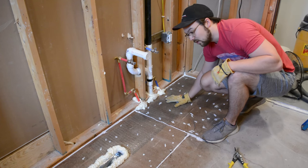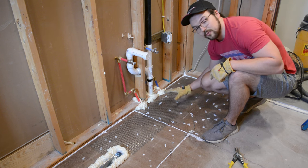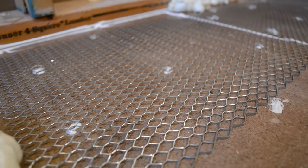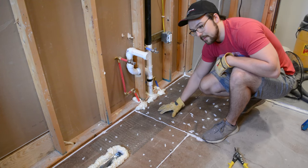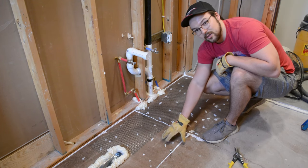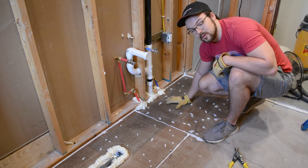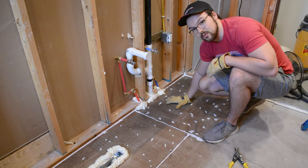The next step is to install metal lath. This reinforces the concrete and prevents it from cracking later down the line. It's only about an eighth of an inch thick, so I'm only putting it on the back half of my pour — out in the feathered area it'll be too shallow. I'm securing it with staples so it doesn't float in the concrete and stays on the floor.